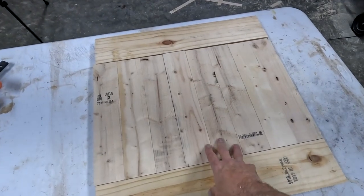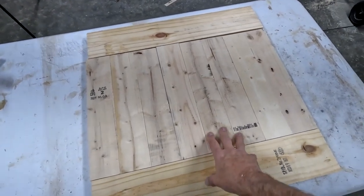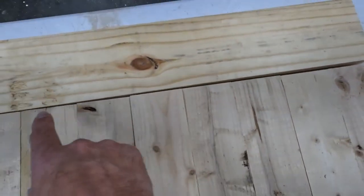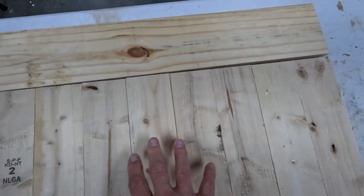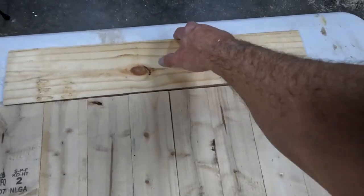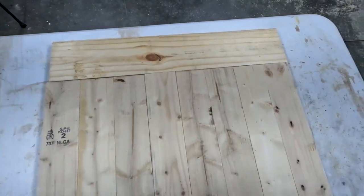Time to work on the top. I left these a little longer at the beginning, so I'll flush out this side first. If there's a crack or groove when I clamp, glue, and pocket screw everything together, I'll take my saw and run a nice straight edge across there so when I butt this side out it fits in perfectly.